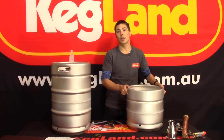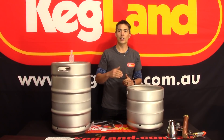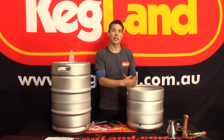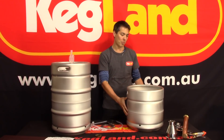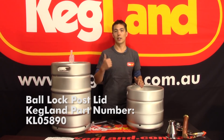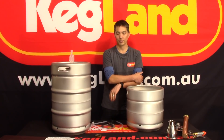It's also small enough that we can reach relatively high pressures. When you go larger and larger in the lid opening on any of these pressure vessels, it gets significantly harder to reach higher pressures. So we wanted to make sure we're producing a Keg Mentor which can go up to pressures you can use for pushing beer directly out through a filter, dispensing directly from this vessel in your fridge or kegerator, or carbonating and naturally carbonating in the vessel.